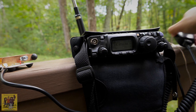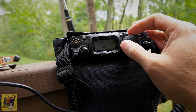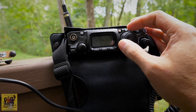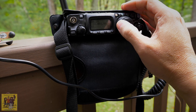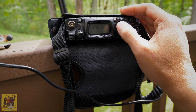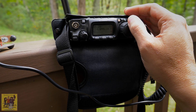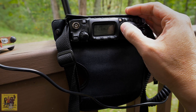Let's see what we can hear today. I'm not having any issue with this antenna for receive — it actually does pretty good. Unfortunately it could potentially be awesome for digital modes, except as soon as you have any kind of electronics around with this antenna you won't hear anything, all you'll hear is hiss. But when all you have is your key and your mic it's clear — good clean receive. It'd be so awesome to use this antenna for digital modes but it just isn't going to cut it. Watch my other videos regarding this antenna and you'll know what I'm talking about. Pretty much it goes deaf, all you hear is local noise, but for receive, if you don't have a lot of noise sources, it's really good.